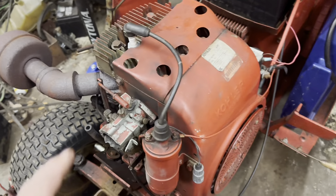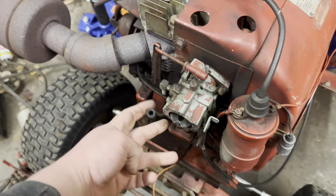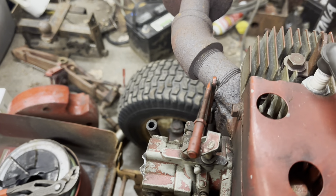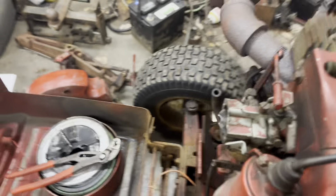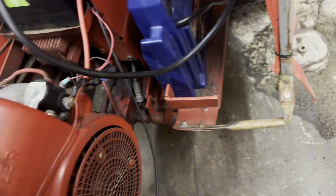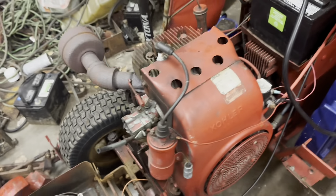She's inside — went ahead and pulled the fuel line off. I'm going to go ahead and crank it over and see if the fuel pump is pumping, because that also could be a problem. Maybe the carburetor is perfectly clean and it's just not pumping properly. Let me get the battery charger hooked back up and we'll give it a shot. No fuel. That could mean we have a clogged line or a clogged filter somewhere. It is old fuel line. I'm going to go ahead and rig up a test tank and see if it'll run on its own, just off of a gravity feed test tank.